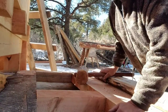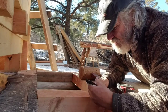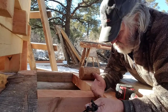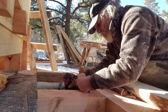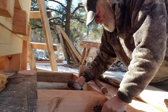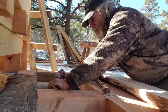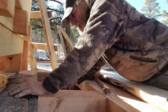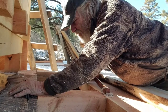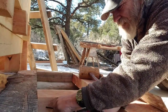There we go. Okay. Grab those timber locks. These bolts are hardened steel, and they're engineered to be equivalent of a 3/8" lag screw. So basically, you don't need joist hangers or anything for this kind of stuff. It's structural. So it's basically like toe nailing, but using bolts.